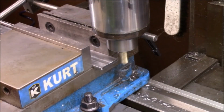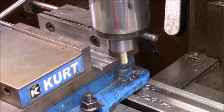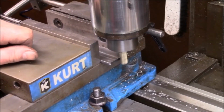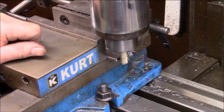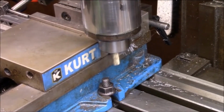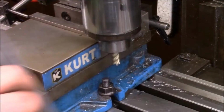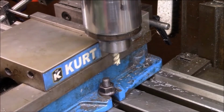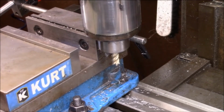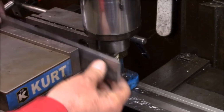this one, and that was the reason I done it. So one of them was a little longer than the other. And then we'll go back with this one. Notice about 20 thou off of this one. And then we'll put the other in and mill back through it. Mill it to be the same. Oh, okay. So, this is the only way you're going to ensure that you get them pretty much the same. So, we're just doing it this way. Then we're going to flip them around. Then we're going to mill the other sides off too.